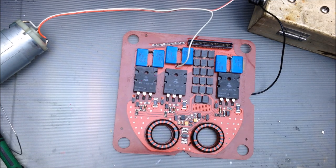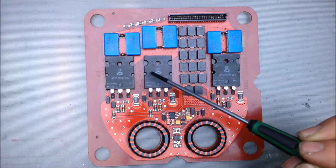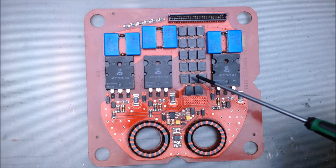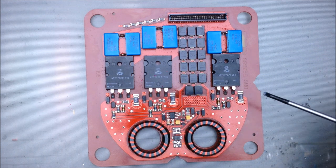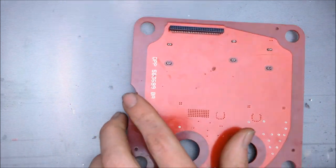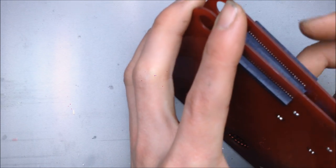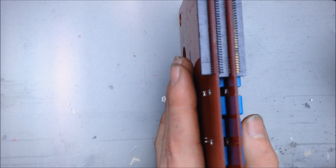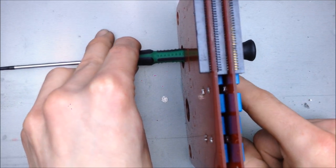Now let's take a look at why these boards are in fact so mind-blowing. These boards are over-engineered big time — they've got all these redundant connectors for the input and output for the MOSFETs. These are 1600-volt capacitors apiece. All these TVS diodes are rated for really high currents, and each one of the MOSFET gates is protected along with the gate drive IC. It's also reverse protected. Another feature is this header right here, which is a male header, and on the other side of the board is a female header in the exact same location. Each one of these boards connects together like this, meaning each board connects in series and acts as a switch that can be fired at the same time by passing the same pulse through the firing conductor that triggers each one of these ferrite cores.